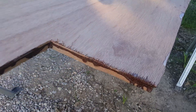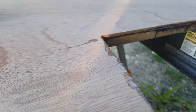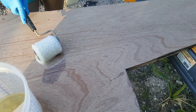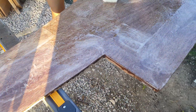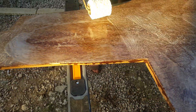We've got a wet-on-wet surface all the way around — we'll press those together in just a minute. I made a little mark so I don't mess this up. We're going to coat this surface with the epoxy resin and slam on the last three-quarter-inch side, then start clamping it down. The quarter-inch sheet is covered — you can see the speckles of fiberglass in there. We'll coat the three-quarter-inch side on the other end that meets up to this one, and then start clamping.